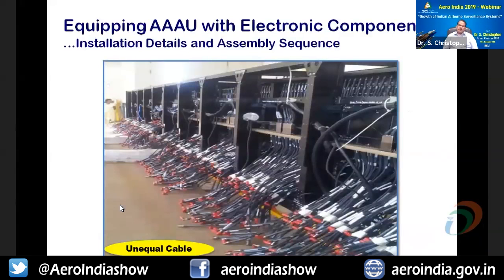Next, in addition to the structural aspect, on the electronics, the TR module is only generating the power. The power needs to reach none other than the antenna elements themselves. Unlike the world's systems where there is no electronic scanning in elevation and only azimuthal scanning is covered, here we have taken the responsibility of including electronic scanning in elevation. That is how the number of cables is much, much higher here. Equivalent to about 2 kilometers of RF cables are utilized to power the 8 elements in elevation, and that gives us a scanning capability.